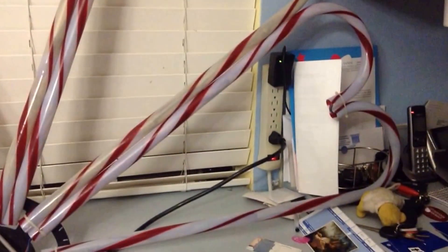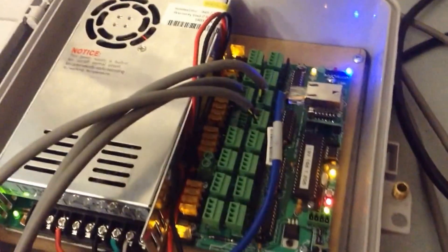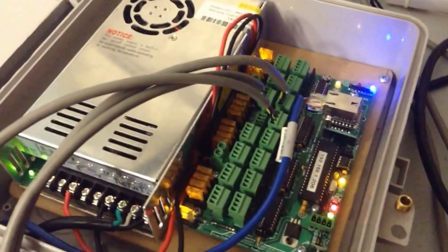It daisy chains one more time, so it's set one, set two, and then the third set is just 20 on the end, so it's a total of 100 pixels for this. I did not do the zig-zag — I actually did the configuration changes for the DMX number actually inside LightOrama itself, and this just works out. I think this is going to work out perfectly.